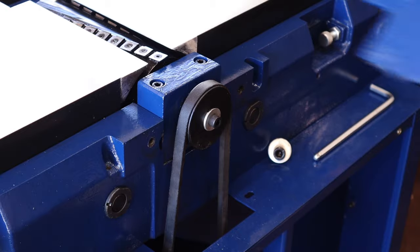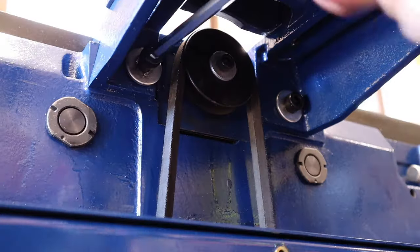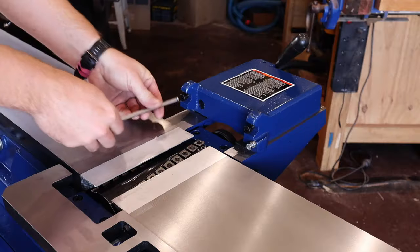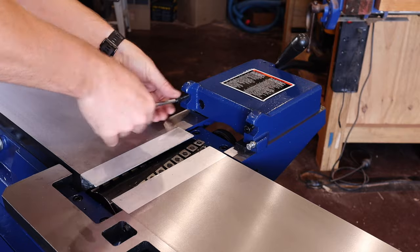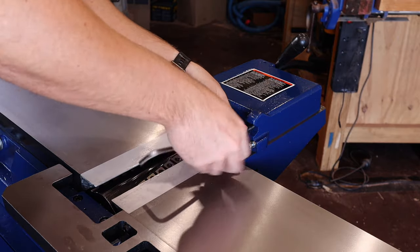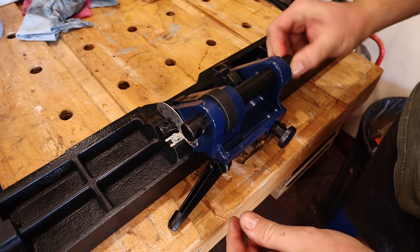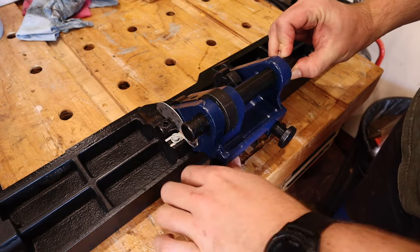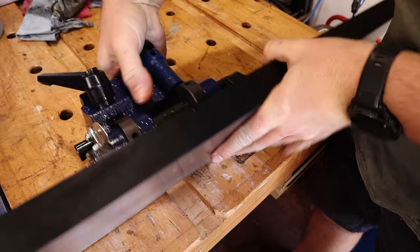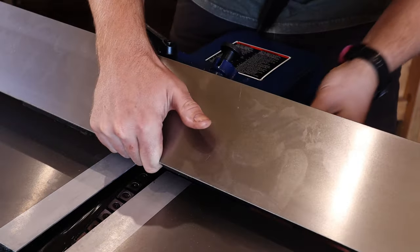This heavy cast iron fence adjustment piece attaches with two 8mm hex bolts that need to be tightened as much as possible to keep the fence nice and sturdy. I'll then remove the two 6mm hex bolts on the front and attach the fence. It's worth noting that the fence is a solid piece of cast iron and weighs a bit, so adjusting the angle before getting it to the jointer makes life a lot easier when you're trying to balance it and screw it in place at the same time.